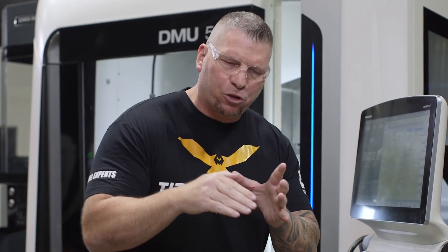I've never cut with this tool before. This is the first time I'm going to hit material with this tool, and we're going to drop down at 45 degrees straight into a full slot. Then I'm going to step up, drop over, drop down, and just go straight into the steel — drive it right through.